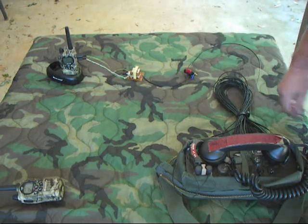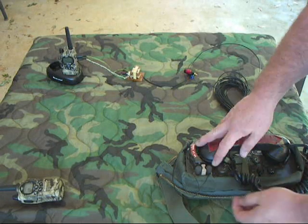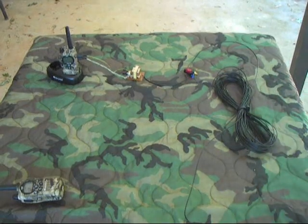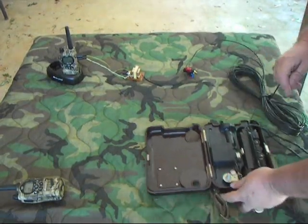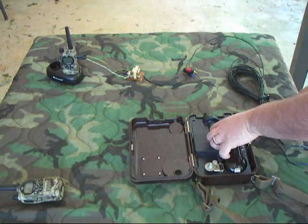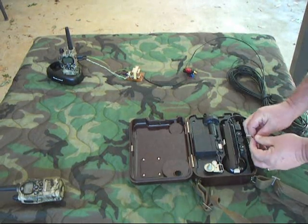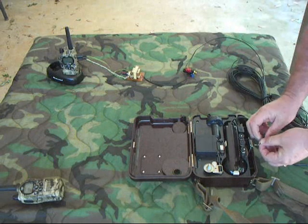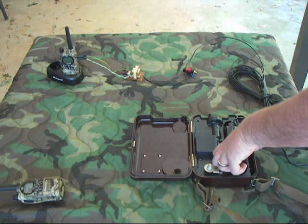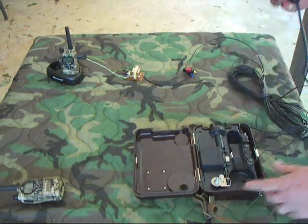I have my binding posts on here. Hopefully I'll put this into a box sometime and test from there. Now we're going to go even crazier — we're going to get rid of our TA312 and install our TA57, made by the Soviet Union. I want to do this because the TA57 has much higher output levels than the 312, since the Russians built them with actual amplifiers on the microphone output side — so it's a little bit louder.